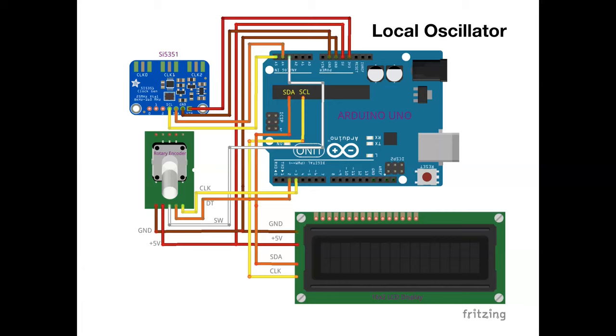And what's really changed is all those little pins at the top on that representation of the LCD display. When I first started, you used to have to solder to every one of those pins and take every one to an Arduino pin. As you can see, I think it's 16 pins there. You don't have many pins left to do anything else with.